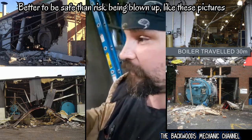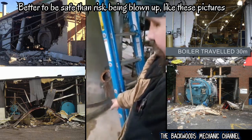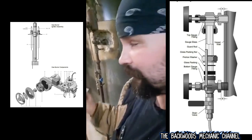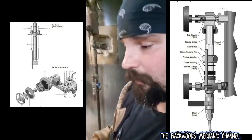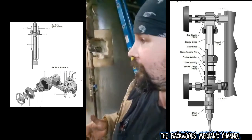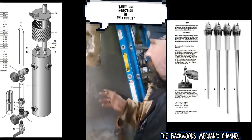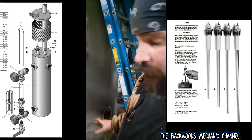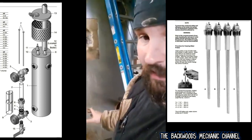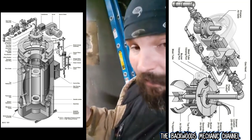On the off chance we didn't want to run it and endanger anybody, we did what we could and then got the certified guys in. They said if it's dripping water all around the bottom, shut it off instantly - that's dangerous and means you have a full leak. There are things called boiler compound you can put in, but different types can mess up the chemistry and erode the inside faster than normal, so you have to test pH levels. The plan is to run it for two or three days, let the insulation dry out. If it dries out and stops steaming, we're good. If it keeps steaming, there could be a pinhole somewhere that could turn into a big problem.